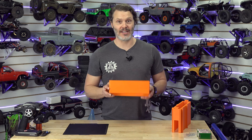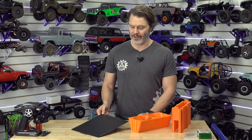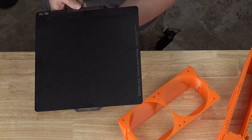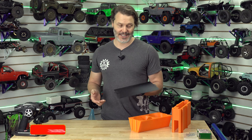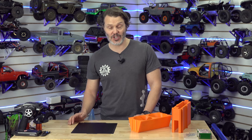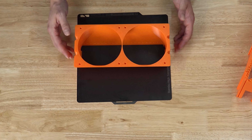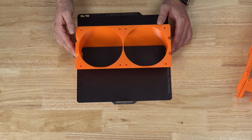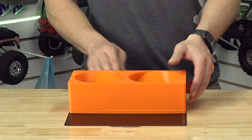In the meantime, I've got some G10 plates — not the thin ones but the thick 1.5 mm ones — and that should solve my problem. I really hope it does, because otherwise the machine is going to be useless for me since almost all I print is PETG. I could switch to ABS, but I'd have fumes and ABS also really needs a heated chamber. Part of the issue is that this print goes all the way to the edge of the build plate — I'm literally 0.1 mm under what I can print — so it's pulling on those edges and curling up during the print.